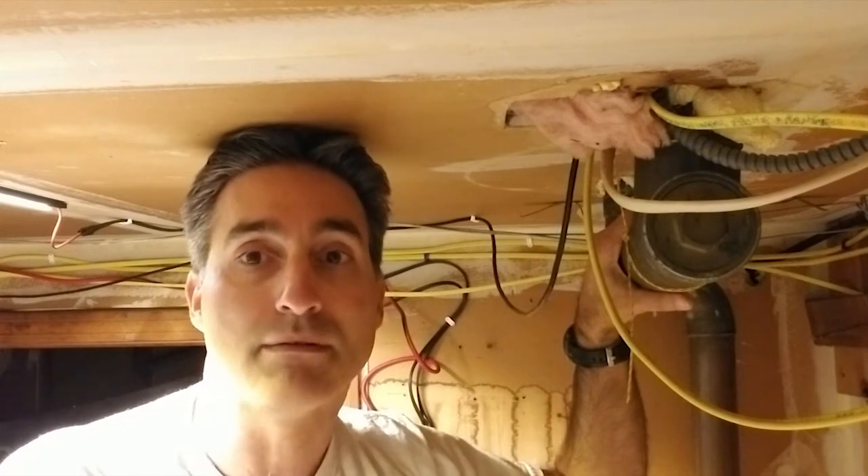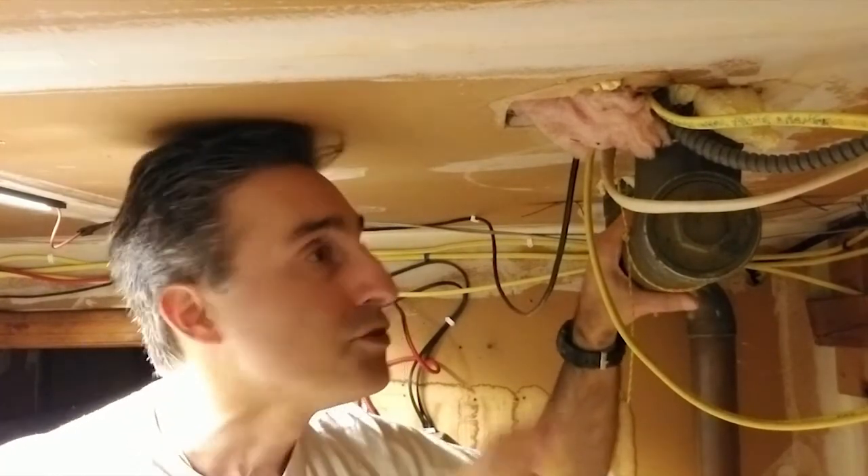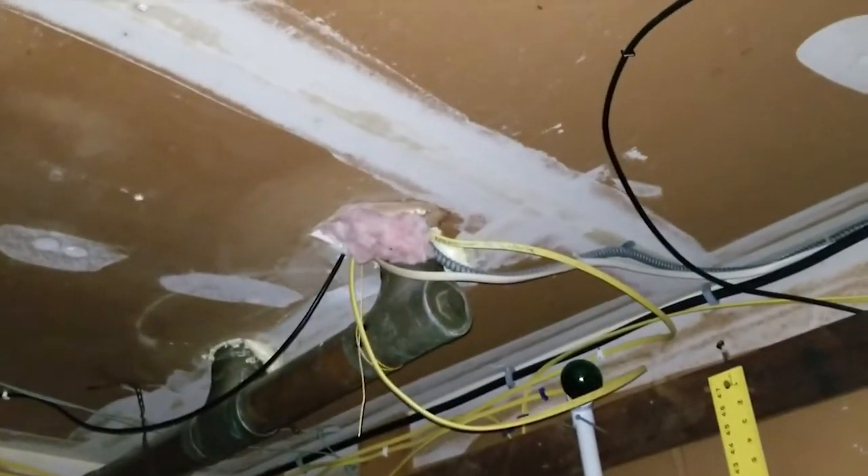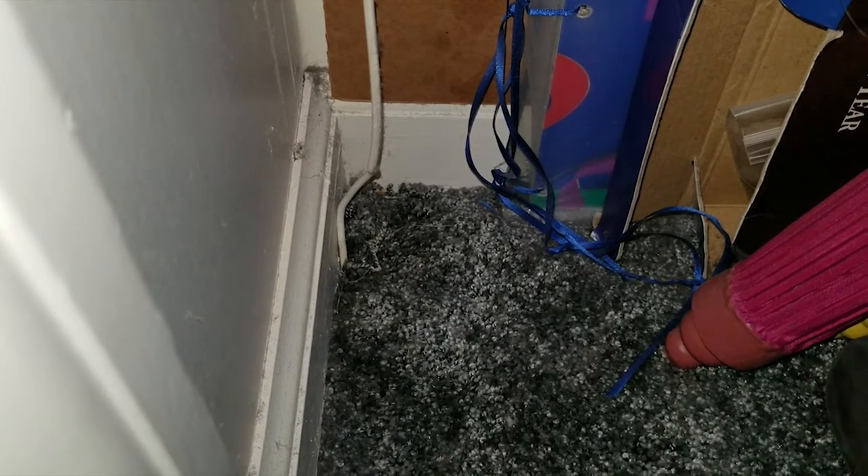The home inspector didn't even catch this during the pre-purchase inspection. So what I'm going to do is pull this ethernet cable out of this channel and reroute it. Standing in the garage, I'm underneath the master bedroom. That plumbing stack is going up in the wall between the bathroom and the master bedroom closet. Over here is the control panel line for the alarm panel, which routes up into the attic to feed the control panel located in the master bedroom. That cable comes up through the floor in the closet and makes its way into the attic through a small hole. Since it routes through the closet, nobody sees it — and I never even noticed it until now. So my plan is to route the ethernet cable through a nearby opening or possibly the same hole to get it up into the attic, so it'll comply with electric code.